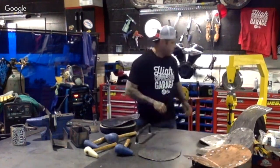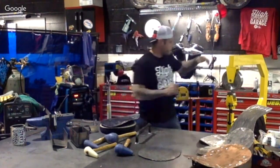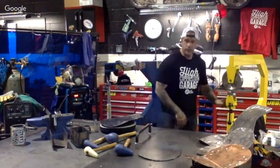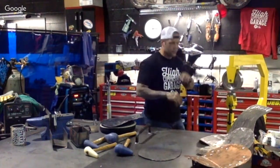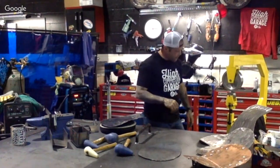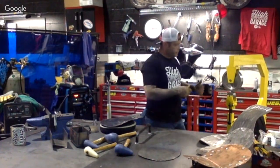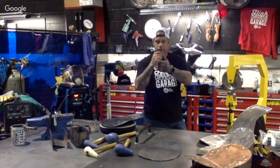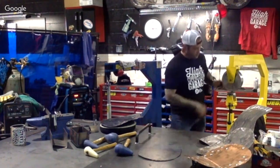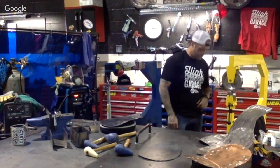All right, I want to show you a few things on the English wheel here. Wow, we're buzzing right through time. When setting up an English wheel, I highly suggest, this is one really wicked tool to have at home. Get one of the benchtop ones, start working with the metal. I call one of these things a finger jammer because I got flat fingers from the get between those wheels. So when using this, put some WD-40 on the wheels, your main wheel and your anvil.